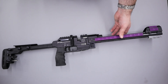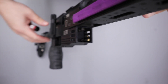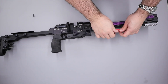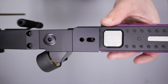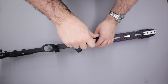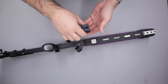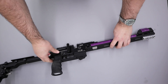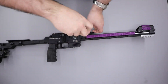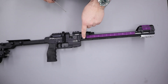Next up to make the rifle a little easier to manipulate for the camera we're going to remove the front rail. So to begin with we'll loosen the two screws in the front of the block here, one on this side and then another on this side, and that's done using a three millimeter allen key. With those removed the next thing we'll do is remove the two screws from the bottom piece there and that will allow us to remove this block entirely. We're going to be loosening these screws using a four millimeter allen key and then with those screws loose we'll just pull the front block off. Up next we can use a two and a half mil allen key to remove the six retention screws for the front rail itself. As you remove these just make a little note: you have two long ones and then one short one. The short one goes in the top hole and the two long ones go in the bottom.